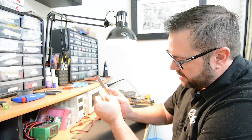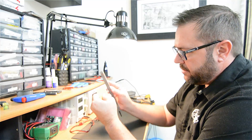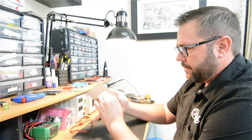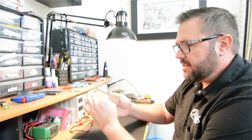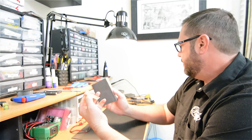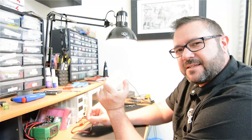Once we've got the circuit board done, we'll just want to file off the little stubs where they were connected to the rest of the board. Once you get that cleaned up, the rest is all good to go. Generally, once you get those tabs worn off, I'll hit it with 220 or finer grit sandpaper just to remove any burrs very, very lightly — just the weight of the board rubbing on it. You obviously don't want to do it much because the layer of copper is very thin depending on your manufacturer and the quality of the board — you might rub right through it. So once we have that, we have a nice clean circuit board.